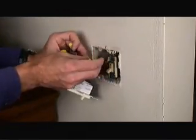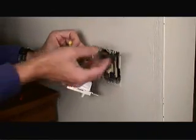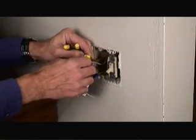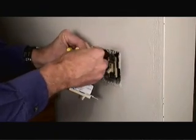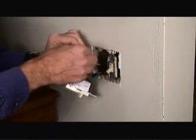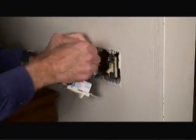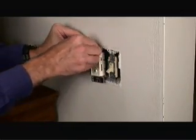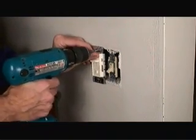For added precaution, when I'm having a switch in a multi-switch outlet box, I like to have a little black tape or electrical tape on the end of the base of the wire nut and around the wires, just so there's no chance of the wires coming loose inside the circuit and potentially causing an electrical situation. So once we push the wires back into the box, we can use our fastening screws to mount the dimmer switch to the front of the switch box.